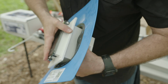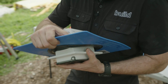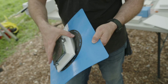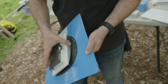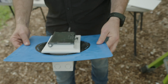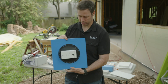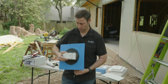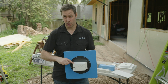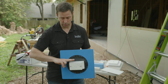This is really cool. It's actually physically produced for this specific box. And you can see now it's just like a roof jack. It's got a neoprene gasket on there. And once we screw this to the wall, tape it on all sides, or liquid flash it, that's gonna be nice and water and airtight, even if that was poking into my house. However, if this was into the house, you're gonna notice this has some knockouts for the electrician to run their wires. We'd wanna tape over those.